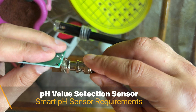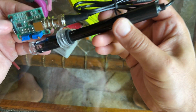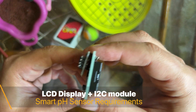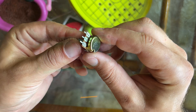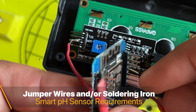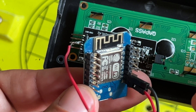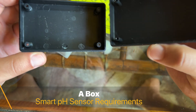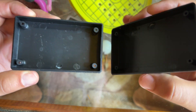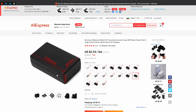Exactly what we are going to do later in the video. Next is the actual pH value detection sensor — a board and a stick with a cap that can hold the liquid to be measured. After that we will need an LCD display plus an I2C module. Also a 5k ohm potentiometer is needed. Some jumper wires to connect everything, and some connectors or a soldering iron with basic soldering skills if you don't use connectors will be needed. Finally, a project box to collect everything in one place is required. You can print such a box if you have a 3D printer, or you can buy a ready-to-use one — this is the style number 7 box from the links in the video description.